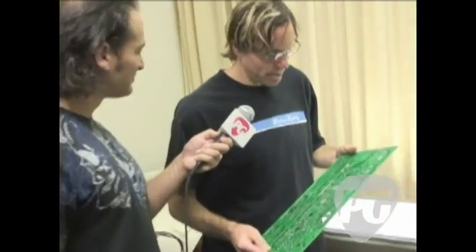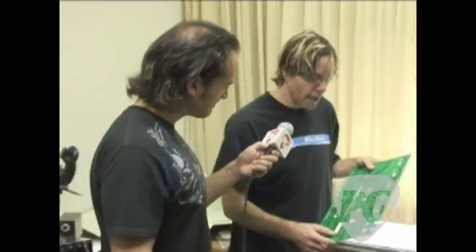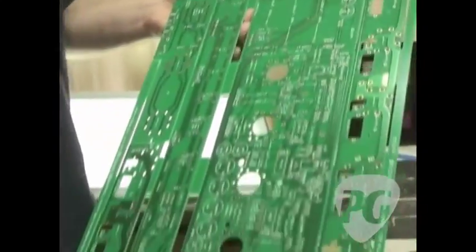This is the next step after the amplifier prototype resting place. This is one of Randy's paintings, so to speak — an example of where he spends a great deal of time dialing in the circuits. The circuit board is where it all happens. This is actually a dual or triple rectifier circuit board. Randy would tell you that all Mesas have always been made with circuit boards — we've never made point-to-point amps per se. Randy did repairs for years before starting Mesa Boogie and came to strong conclusions about the benefits of point-to-point wiring and where it can be applied in circuit board design amps. Our use of circuit boards provides a remarkable amount of consistency, and it facilitates the vast amount of features, options, and modes that Mesa Boogies are known for.